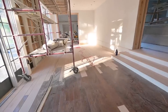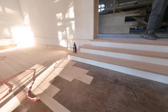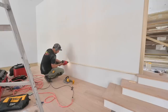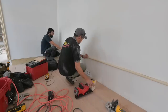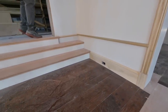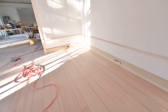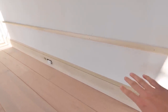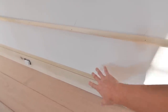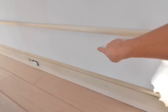The other fun detail in this room is this wainscoting — big base, I've heard it called both ways. You can see that cap there ties in with that top tread, and that's where we determine the height. So this whole room ties together based off the stairs — 18 inches overall. This drywall here is actually going to represent finished wood, so all this trim will be painted white, with another color up here for contrast.